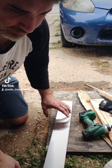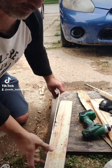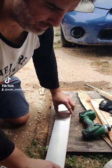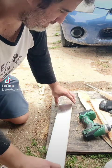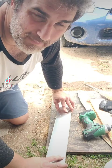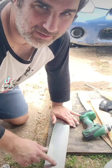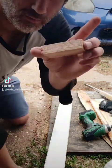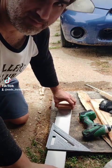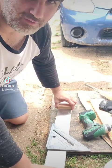The problems that I've run into — because I mill out my own lumber — is that, as you can tell, there's no center line here. The only way you can utilize this is if you had a 3-inch wide fretboard. For me, I mill my own stuff, so I'm not always going to get those kind of cuts. So I've got a solution. I'm going to add these two wood blocks. The idea is to understand where your center lines are on both sides, because not every piece of lumber is going to be 3 inches wide.